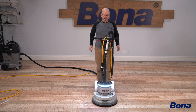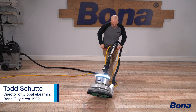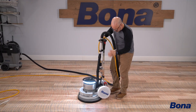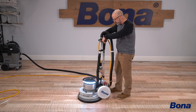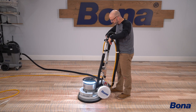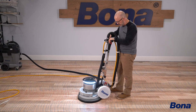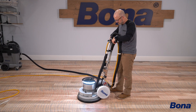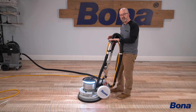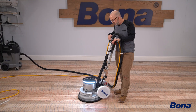We've got the position of the handle. To start this up, there's a safety mechanism down in the bottom of the base that in its upright position does not let me start the machine. So I've got to get it at about 10% tilted back. Sometimes you'll move it back and find it didn't start, so you move it back just a little more until you find a place where that magnetic slide or safety catch releases.